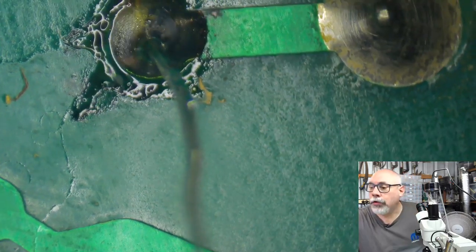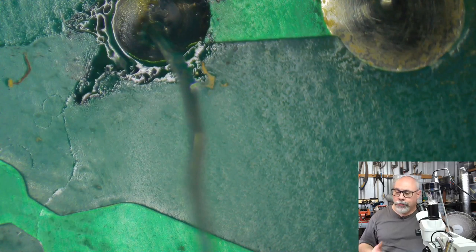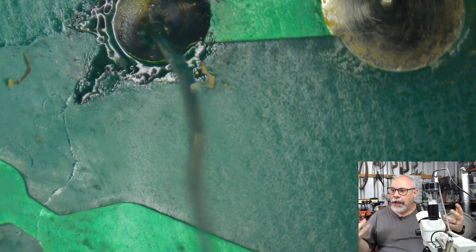last one. What I'm generally doing when I'm soldering these on, I get the solder onto the pin, and then I put my hand underneath and I just push the component up so that it's nice and flush with the board, and make sure it's not hanging out.